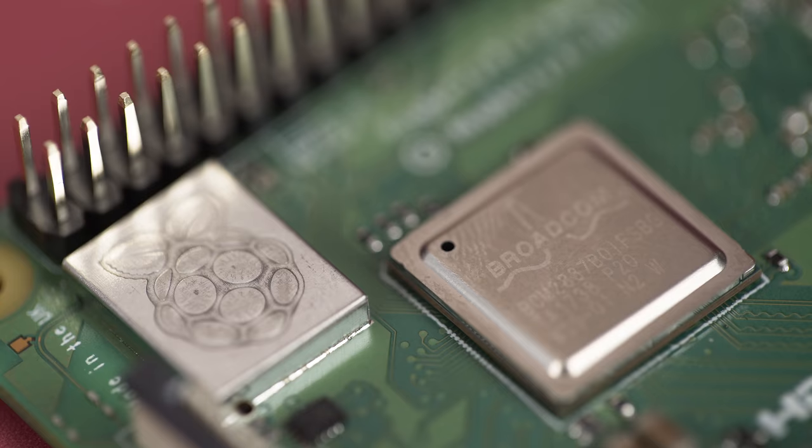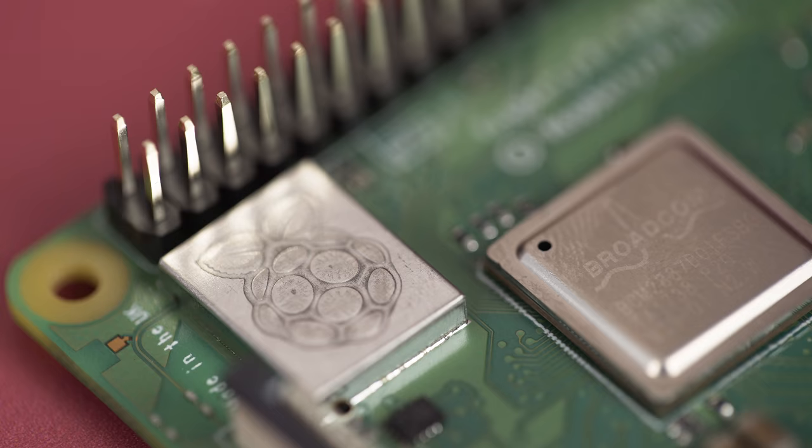Still the 2837, just in a new package to increase power integrity and give us better thermal performance as well. In this corner we've done a lot of connectivity updates, so we've now got 5 GHz and 2.4 GHz Wi-Fi, Bluetooth 4.2 and Bluetooth LE. We've got a new dual band antenna from the same people who did the one on Zero W. Previously Raspberry Pi 3 has a chip antenna along the edge, and people noticed that Zero W has better Wi-Fi — it's got a PCB antenna. It's got generally better Wi-Fi performance than the 3. We took all that learning and put it onto this board, so this one's a dual band antenna. It adds some extra capacitors for tuning the cavity but equally good performance if not better.